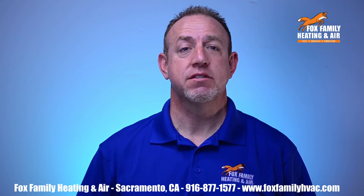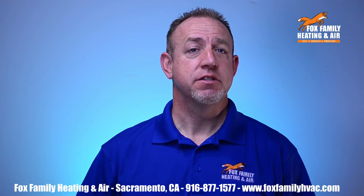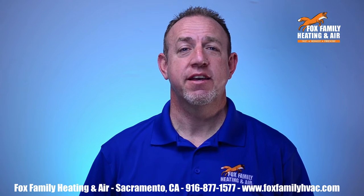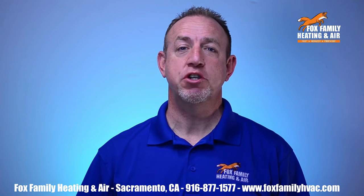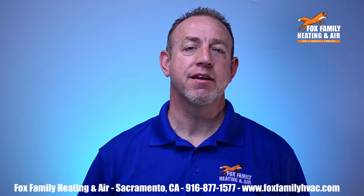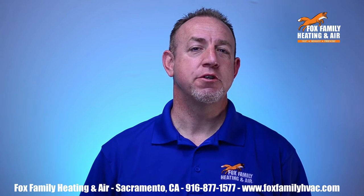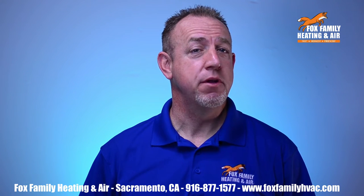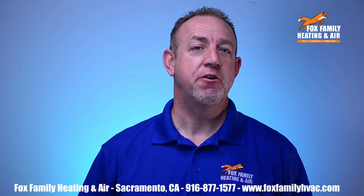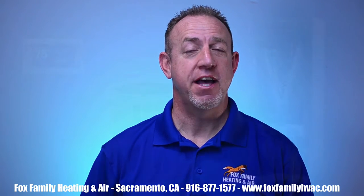In the most basic sense, Comfort-R mode regulates airspeed at startup to carefully control humidity levels. Lower humidity can lead to savings by reducing moisture levels in the air so that you can keep the thermostat at a higher setting and still feel comfortable. Comfort-R mode also offers warmer startup with an all-electric heat pump during the heating season, so you don't feel that blast of cold air when you turn on the heater when you're really looking for that warm and cozy air.